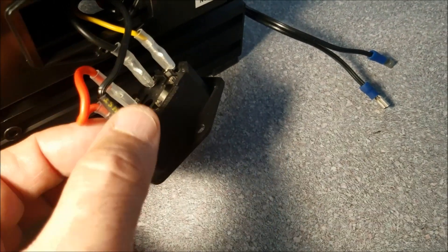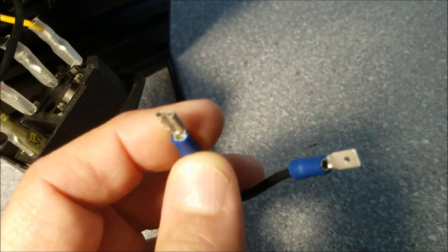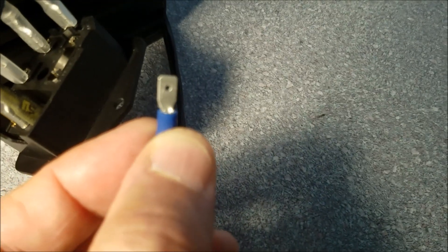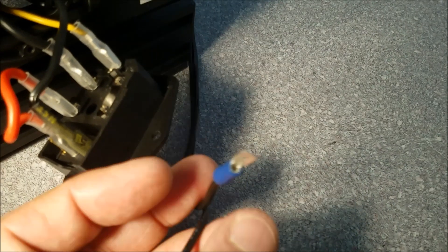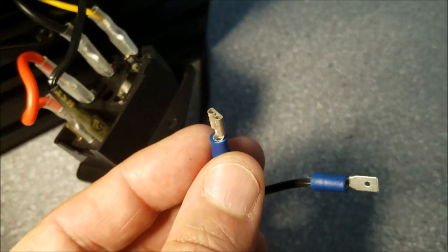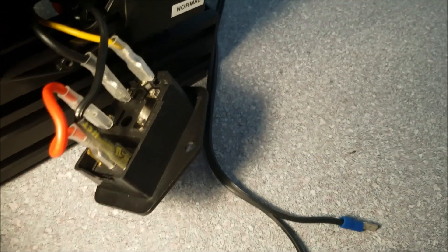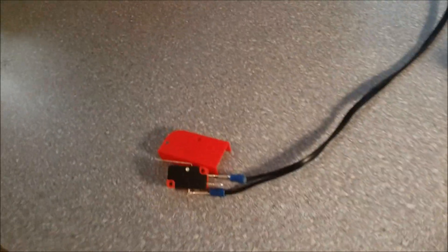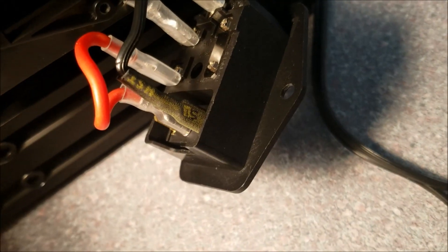But the simplest way to do it is to just pull that wire off. It's got a connector like this holding the blade on — this female connector. You just pull that off and you put this in that connector. Put the blade into the female connector. You can cover it with heat shrink tubing if you like, and then push this connector — the female — onto the blade that is exposed when the wire is pulled. So that basically puts this wire and the switch in the circuit that goes from this switch to the power supply unit. So it is just two switches in a wire.